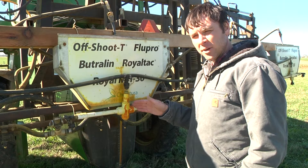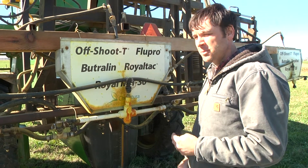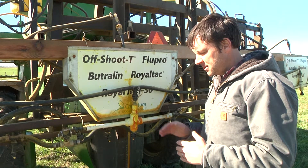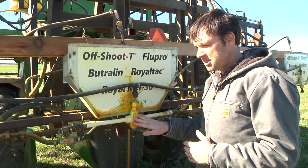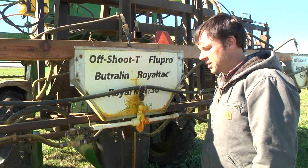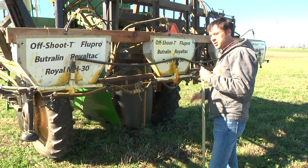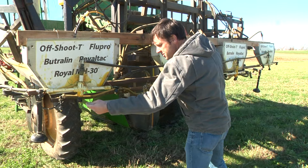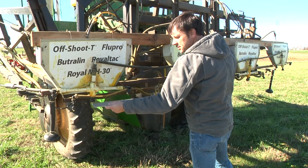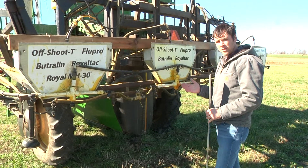This nozzle arrangement only works if the tobacco is straight up and hasn't been windblown. If the tobacco is windblown and not in line, some plants will be missed by this type of nozzle arrangement, whereas a broadcast boom will still reach plants that are bent over. For nozzle spacing with this arrangement, use row spacing, which should be the same as the measurement from center nozzle to center nozzle — typically anywhere from 40 to 42 inches.